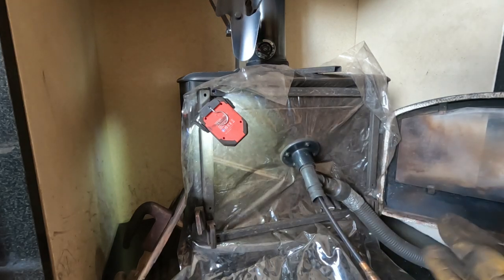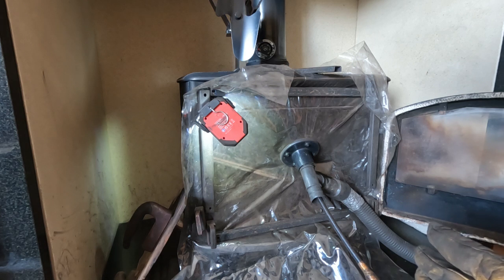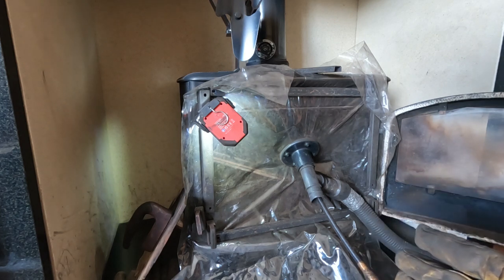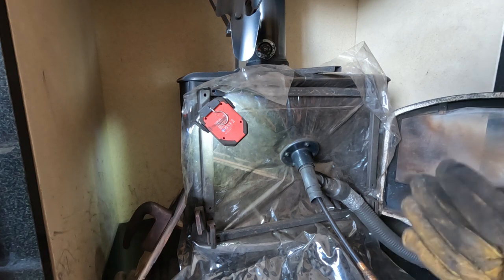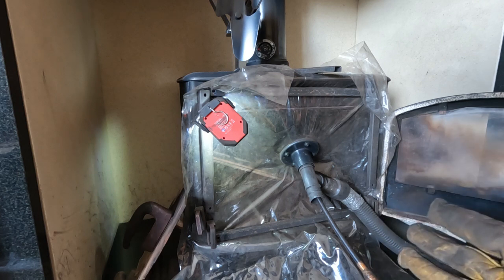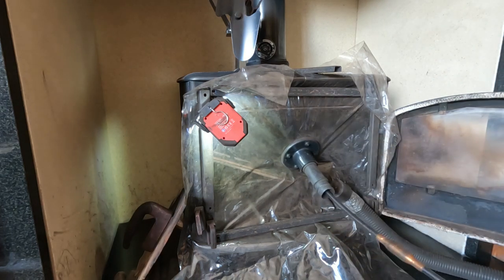I don't know if you can see, but the soot's changed. At the very top, it is quite tarry. And then now I'm a bit further down, it's more powdery. And that's because it's cooler at the top and you get a lot more creosote build up where it's cooler. Further down it's a lot drier, less condensation, so the soot builds up more powdery. So you can see that change then. I don't know if it was obvious on the camera.